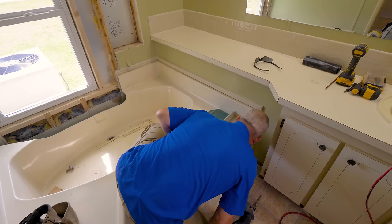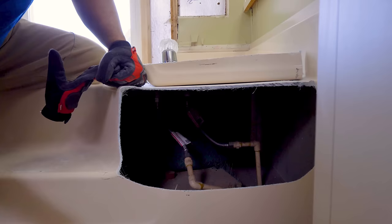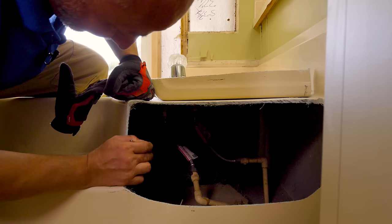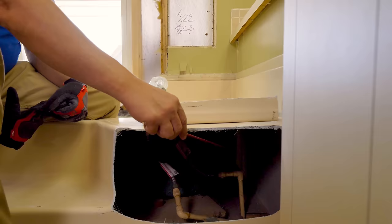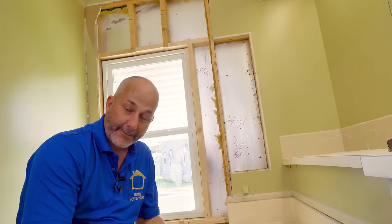The good news is we have CPVC water supply with half-inch thread, so I can take off this faucet riser and just throw a cap on that, leaving the plumbing intact for now. Then we can sort out how we're going to integrate that plumbing into the wall. At least tonight we can finish the rest of the demo and be able to turn the water back on — key, because we still need to use the toilet while we're working.